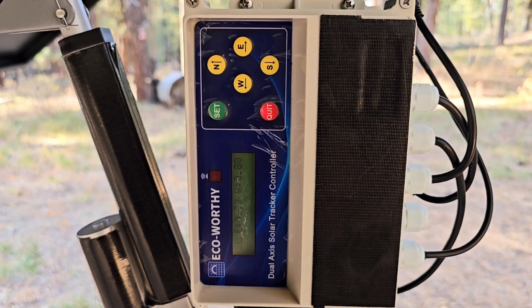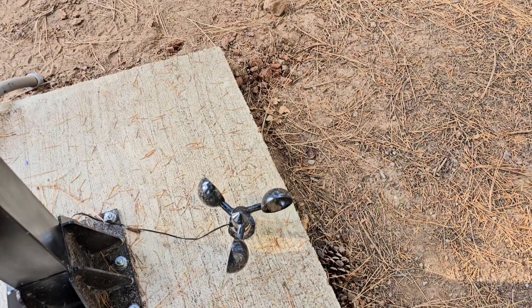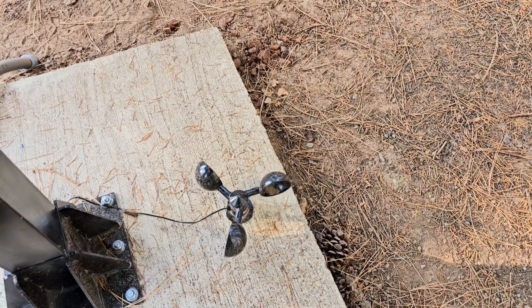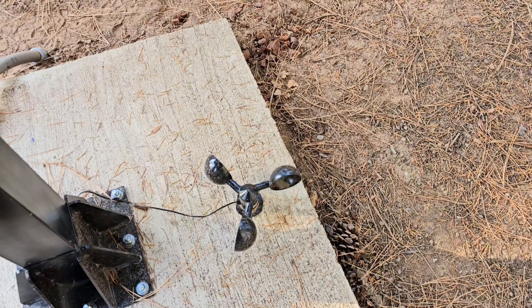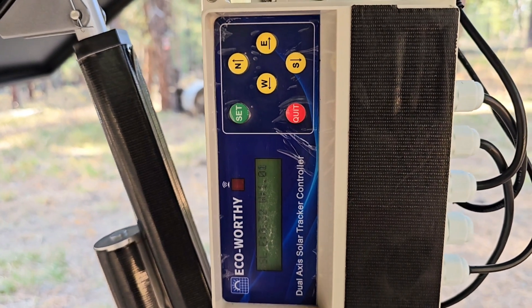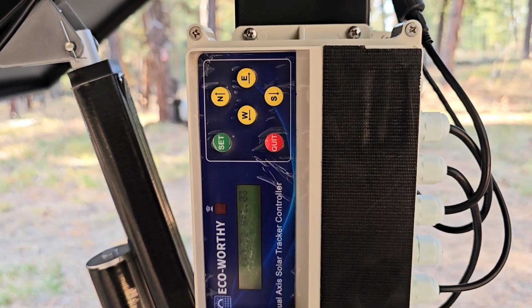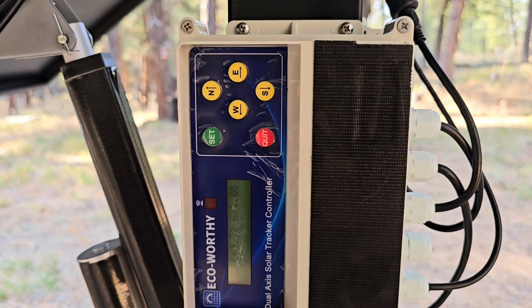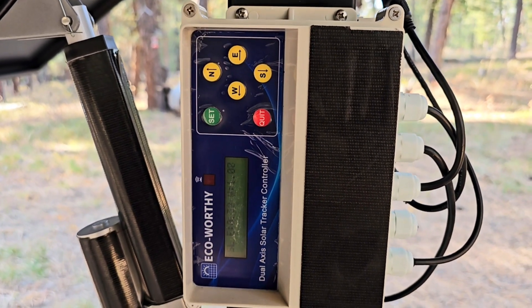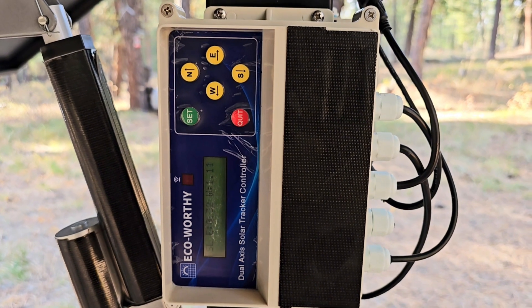Once you've programmed the resting state or low light position, it's really easy to program the high wind setting. This wind sensor unit will detect the wind, and if the wind reaches a certain amount preset in the controller, you can change it, but I would not recommend that — leave the factory setting for the wind speed sensor. Go into your T3, T4, T5, and T6 settings. That's going to be the same settings as what you just put in for the low light return, except on the last position to the south, just put zero. That will leave the unit flat so that if the wind picks up, it won't cause damage to your solar panels or the solar tracker.